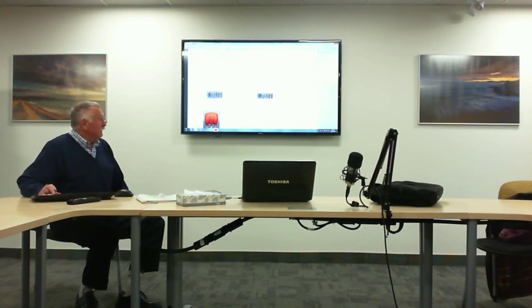This is an illustration of how an FM signal that picks up noise on the top and the bottom is passed through the limiter to promote even amplification. And this is a so-called ceramic filter, 10.7 MHz filter. 10.7 MHz is one of the many standard values for intermediate frequencies for FM radios.